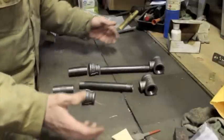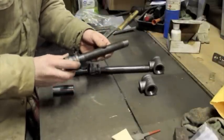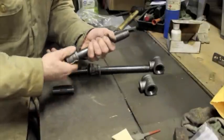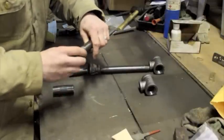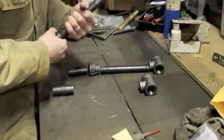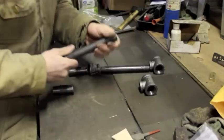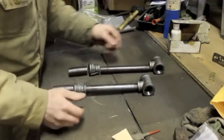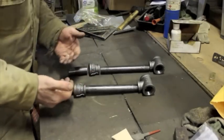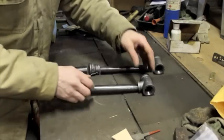That's the basic concept behind these burners. Not to be confused with forced air burners, where you have some sort of powered source of air that is pressurized — like a blower — and it forces air into the system. Those are great too, and generally used for applications where you need an easier way to get extreme heat, such as melting steel, which is not the application for a forge.